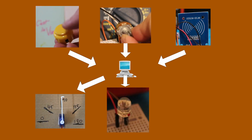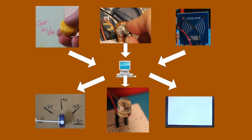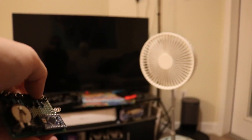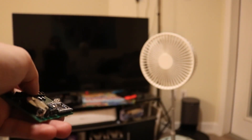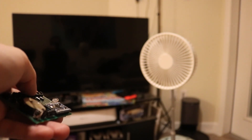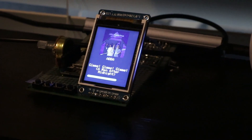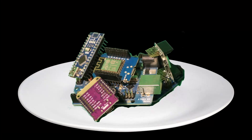With our display and sound figured out, now we need to move on to what's going to be running this whole show. I'm going to be using something called a microcontroller, which is basically just a tiny computer that can read inputs and control outputs. I've used a lot of different microcontrollers for my projects, each with their own strengths and weaknesses. The Arduino Pro Mini, for example, uses almost no power in its sleep state, which makes it perfect for battery-powered operations like my universal remote. And the ESP8266 can connect to Wi-Fi, which made it perfect for controlling Spotify. For this project though, we needed something a little bit more powerful, and with a good amount of inputs and outputs in order to control the screen.